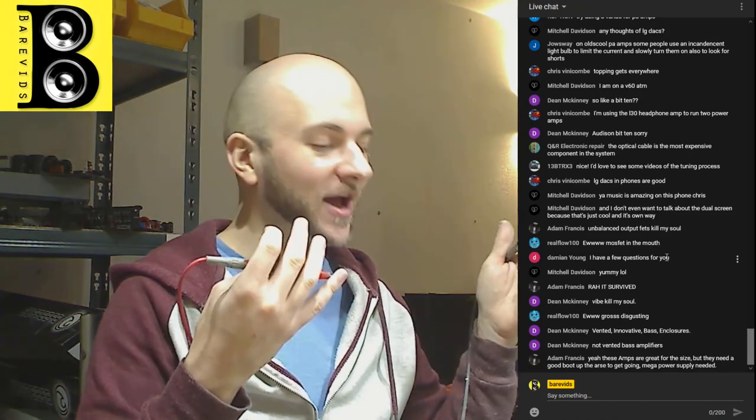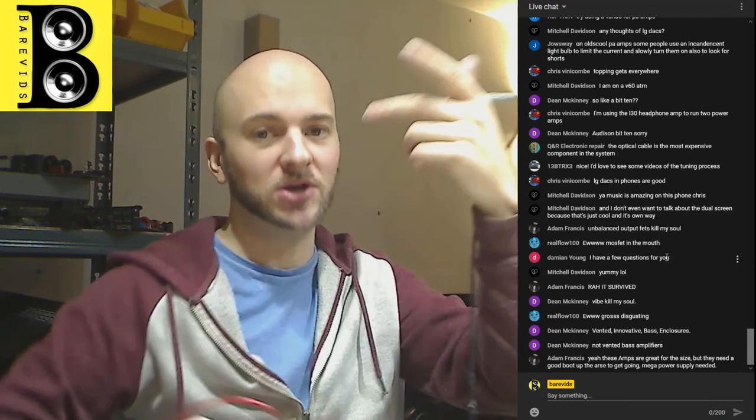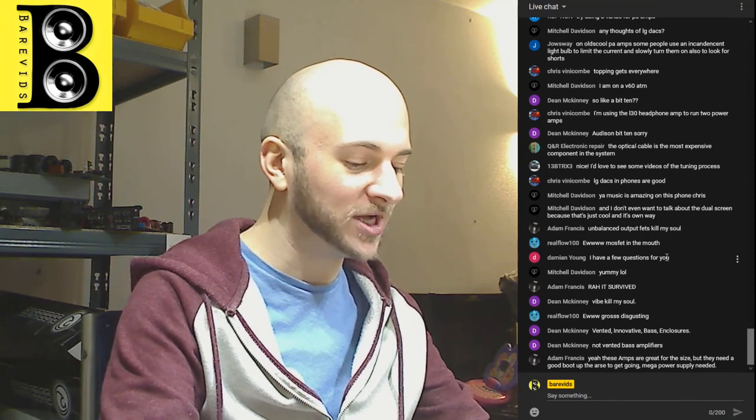Brazilian amplifiers do this. Brazilian amplifiers have a health check mode before they power up fully, and the amplifier checks to see whether rail voltages are able to be built first before turning on fully. But this amplifier doesn't have any of that, so it just kills the whole power supply section.